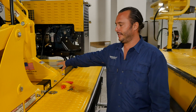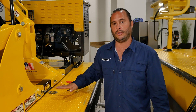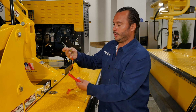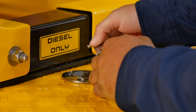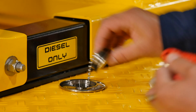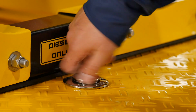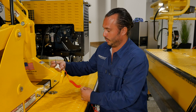The WeDo features an 11-gallon fuel cell mounted inside the hull underneath the rearmost hatch. The fuel fill is located just to the operator's left side, and there's a key that comes with your keychain to unlock the fuel cap and add fuel to the vessel. After adding fuel, be sure there's no debris that went in there, and make sure to reinstall the fuel cap nice and tight with the key provided.